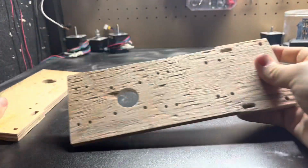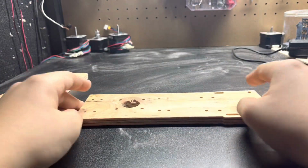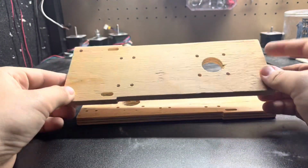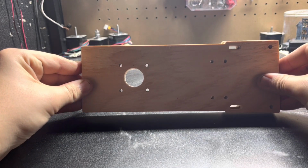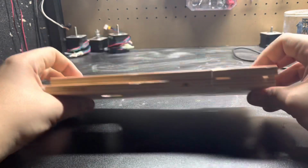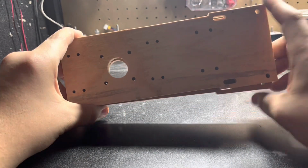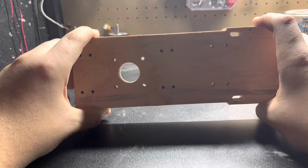Alright, I've cut the 2 pieces out. This is the one that just came off the bed, the one I was talking about with the holes, and this is the first one, the missing holes. I line these up. They're both dimensionally accurate, and I like the way the machine cuts with plywood, because it's just really smooth, and I just like seeing it. It's just amazing.